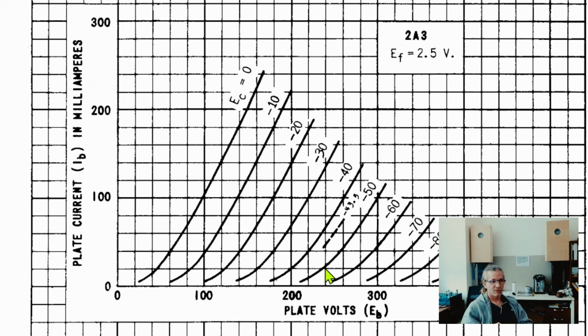And what would be the average of this thing? That would be 20 plus 135, 155, so it would be like 78 milliamps is the average. So basically, the quiescent current is 65 milliamps, but when we push the input signal plus 10, minus 10, the average current draw increases to 77 milliamps from 65.